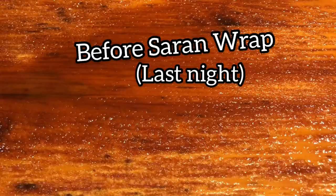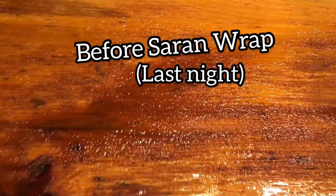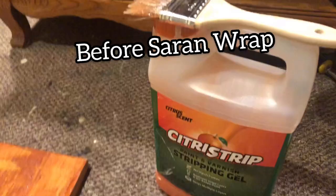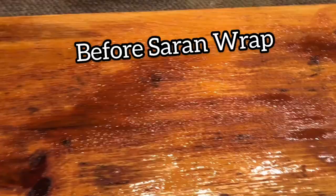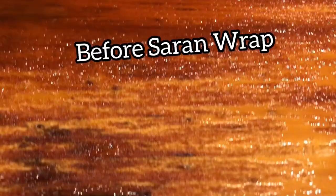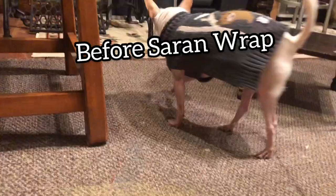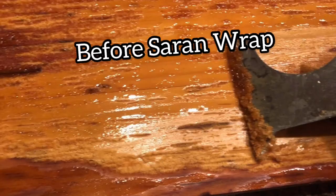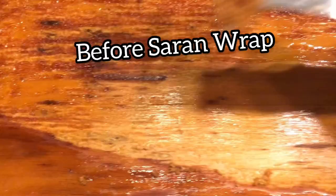What's this gooey mess? Well, I tried sanding off this thick finish off this board this morning and sanding wasn't really working even when I was down to 80 grit, so I had to end up using some Citra Strip. Now it's starting to lift it off — you see that? That's what I want to see. So now I've got to scrape some of this off and see if it'll lift a little bit. Oh there we go — that's the old finish coming off right there. I need to get down to that wood.